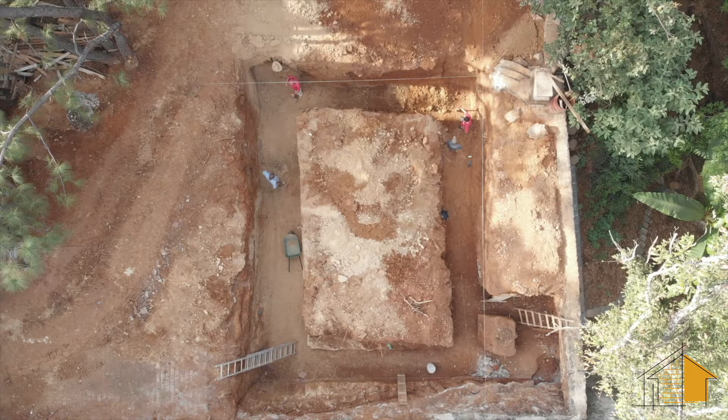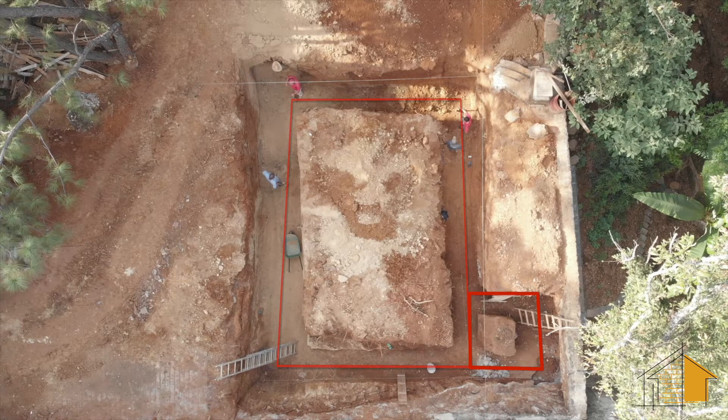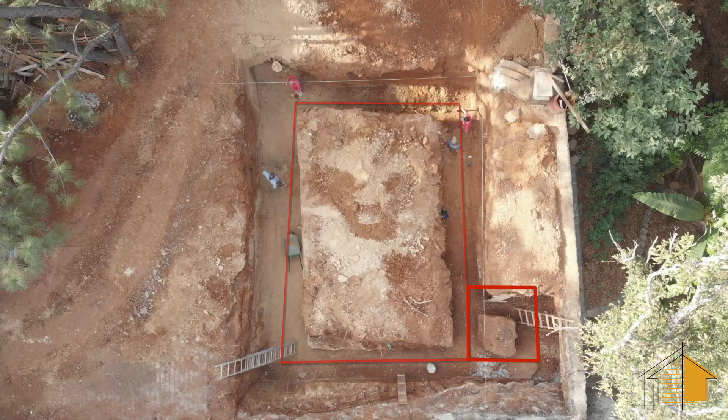The cat operator is finished up with everything he could do with the limited space he has to work in. When we do an overlay of the house plans, you can see that the shape of the house as it's oriented in the plans doesn't fit very neatly into the available area — particularly in the upper left hand corner. That side of the foundation is the most important wall for support of the house, and consequently it also requires the widest foundation base, making it the most difficult one to correct by hand.